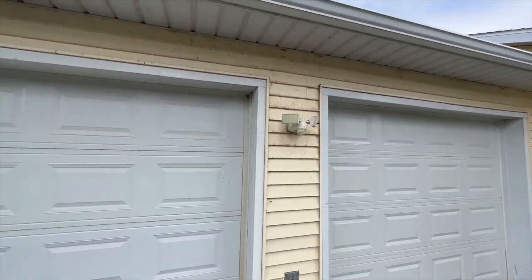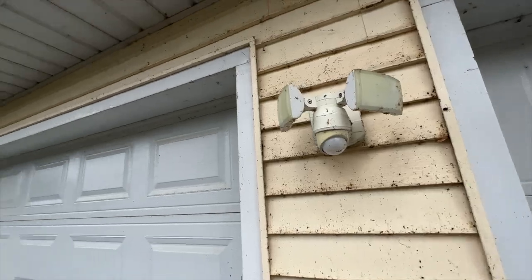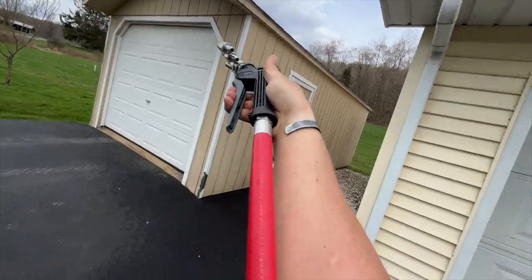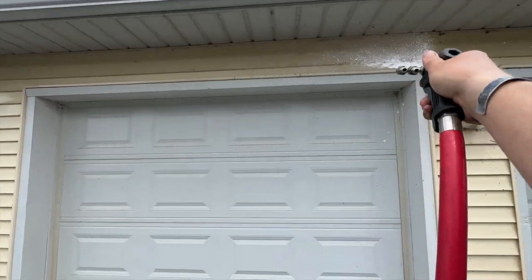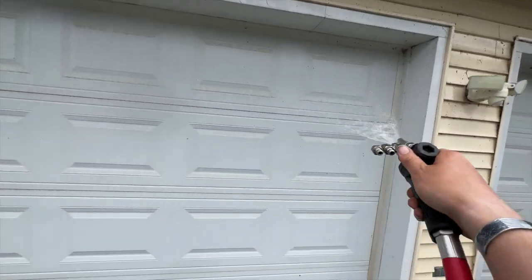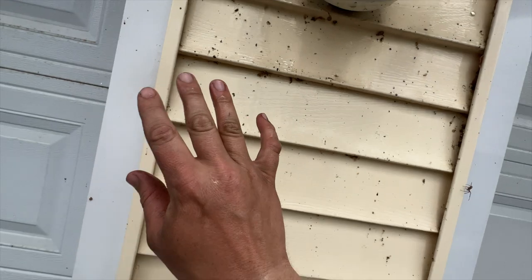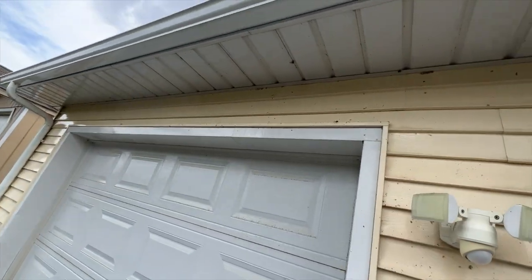I'm gonna make a video showing you guys how I get rid of all this — this is all frass and spiderwebs. What I do to get rid of the spider poop and spiderwebs is I spray the house mix on it: a one percent to one-and-a-half percent sodium hypochlorite and water mix. Let it sit for a while, rinse it, apply it again, rinse again. Sometimes the spots you'll have to come back and give a little encouraging — you might have to brush it with a soft brush. The hard spots sometimes you gotta brush those off, but the rest will wash right off. Wherever you have lights there's always a bunch of spiders — they like the lights at night time.